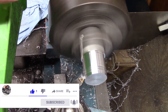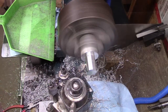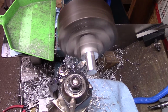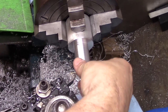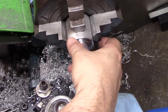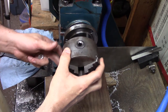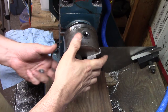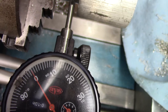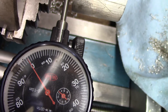We're going to start making the body again and I'm going to do this very quickly because I've basically already showed this process. The big difference here is the way I'm going to hold it. You see I cut down what will be the register for the thrust washer - that's just a locator for the thrust washer, it doesn't have any other purpose. As long as it's roughly where it needs to be we're fine, and then I'm going to cut everything else that's important holding it by the extended part of that register.